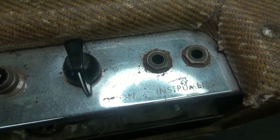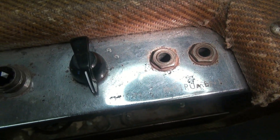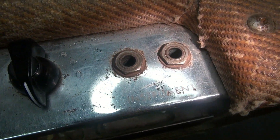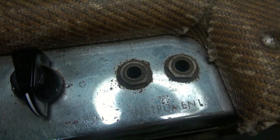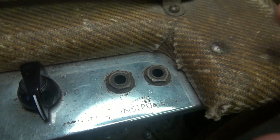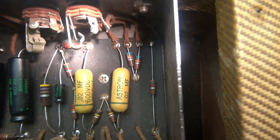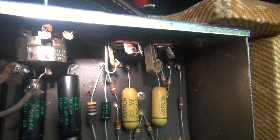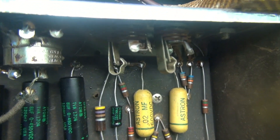The first thing I notice on my visual inspection — if you take a look inside these jacks and shine a light in there, there's a lot of score marks and a lot of corrosion. That's a source of noise, so these jacks are going to have to be replaced. But that's not the worst of it — look at the little shorting contacts on the plugs. Somebody bent them out of place, so the shorting function doesn't work at all on this amp.